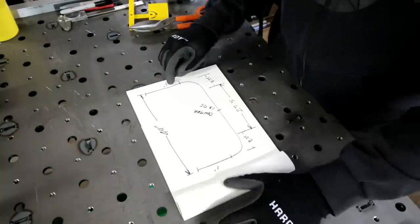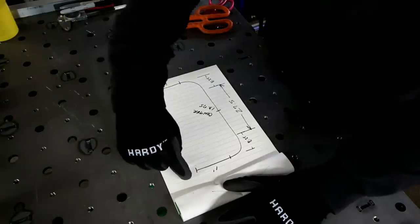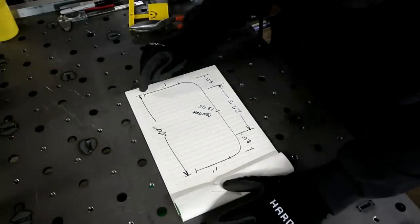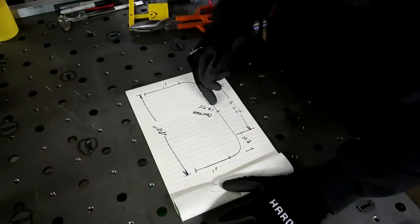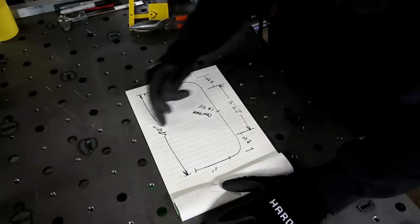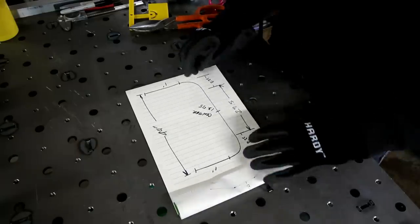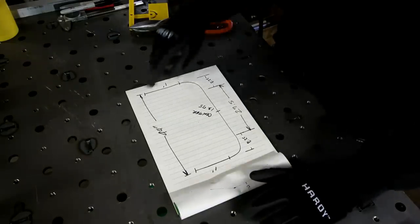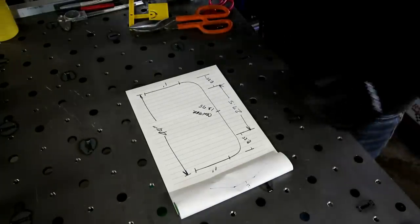I know that from the outside of the one upright bar to the outside of the other upright bar is 44 inches. So that was that measurement. And then I knew that I needed to come back probably like 18 to 19 inches back. So knowing those two things plus the distance it takes to bend 90 degrees with that particular tube, I can figure all this stuff up. I can basically create a bend recipe. And the way that I've done that right here